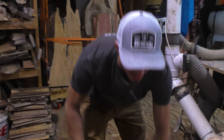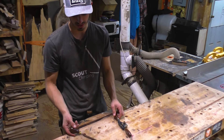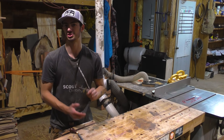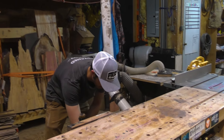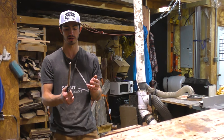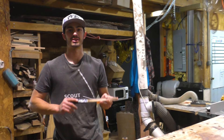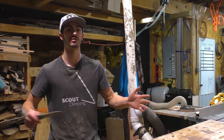These are my most-used hand tools by far. I use the spokeshave daily and the drawknife probably every other day. I got the Veritas ones from Lee Valley — they work great. I've had them eight months and haven't sharpened them yet, that's how hard the steel is. I also have a variety of Kutzall rasps — this one is four years old and still cutting great. Very affordable. If you're going to buy any rasp, I'd recommend the Kutzall ones — specifically the six-inch half round, you can do everything with it.